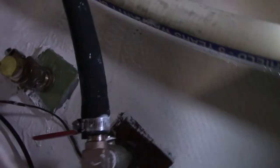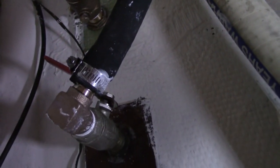I can't wait till they put the 3/4 one out. I may change this out for that. I don't know. But anyway, I did that. I knocked out the old through-hull that was there, and it had like the faucet on it, like you have on your house. And that was rusted shut. Luckily it was rusted shut. So I pounded that out, I got that put in.